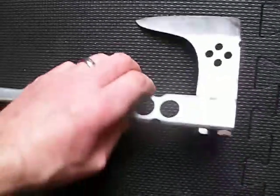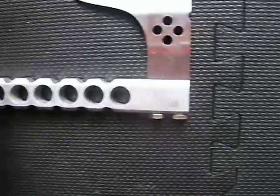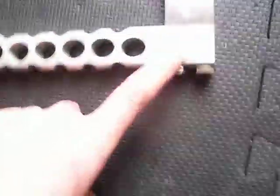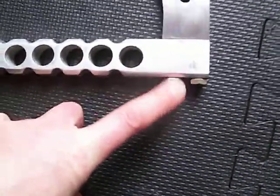When you're actually impacting something, it just closes — it just makes this tighter. And if you get stuck and pull it out, you're loading these bolts in tension, which is what they're built for. The probably weak spot would be in shear, but I couldn't break this with hand pressure, and I was fairly violent with it — I weigh 200 pounds.